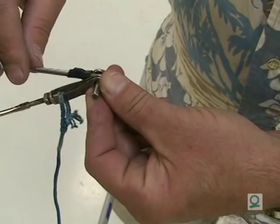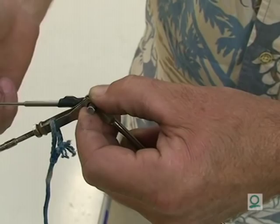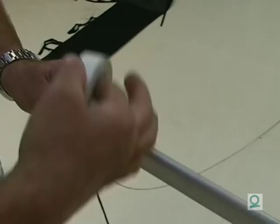When we hook the shrouds up to the spreader pin, we like to make sure that the knurled part is facing forward so it doesn't have any chance of ripping our sail when we're going downwind. Additionally, we want to make sure that this isn't twisted when we're putting it together. Once we get the screw in tight, we want to be sure to wrap this with a piece of tape so it can't come out when we go sailing. Otherwise, you can lose your shrouds and lose your rig.